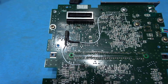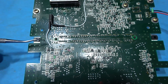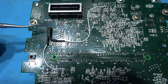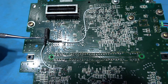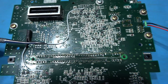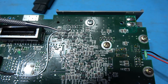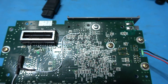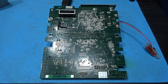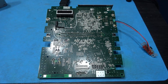That's the CSYNC mod wired in. As you can see, here's CSYNC comes out, goes into the positive leg of the 220 microfarad electrolytic capacitor, the negative leg comes out, we go through a 430 ohm resistor, we come up and connect to the pin 9 that we cut. And that's the CSYNC mod. What I'm going to do now is just flip this over, give it a quick test, just make sure it works before I put it all back together.